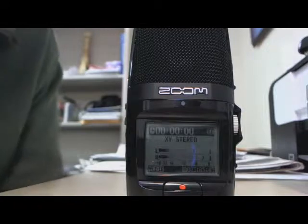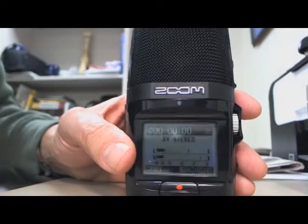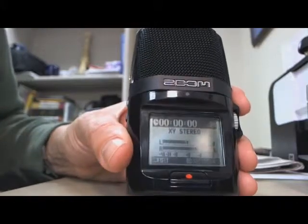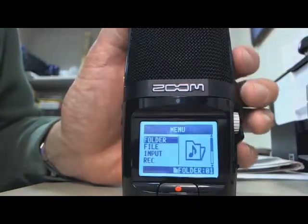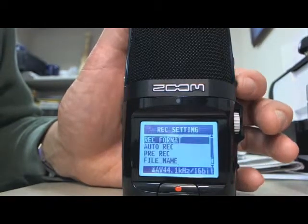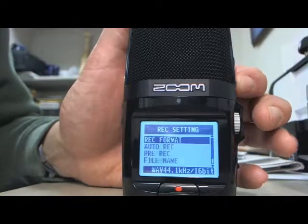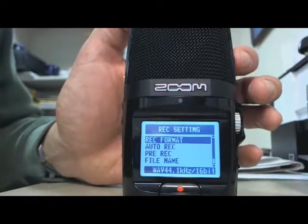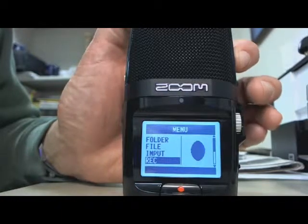If I've got my mic set right, I need to check my recording format — whether I'm set to recording WAV 44.1/16 or not. I can see already right down here it says 44.1/16. If I wasn't sure, I can go to the menu button on the side. I could use the toggle part of the play button to go down to Record, and push the play button in to activate it. I can see record format is WAV 44.1/16-bit, which is what I want. I could press this in to see all of them and make choices, but I don't want to change it. I'm going to press Menu to go back. There are many other choices you could make here, but we're not going to worry about those — hopefully they're all set properly. Don't play with them.